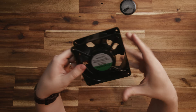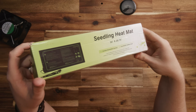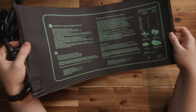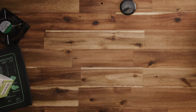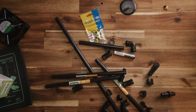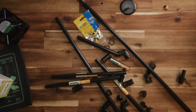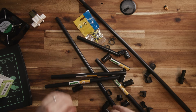To add heat so the little fiery fellas keep thriving on cold Victorian days, I'm using these cheap seedling heaters. They're only 20 watts, so they won't blow up the power bill too much, and they're waterproof. To add humidity, I'm using a cheap irrigation hose and misters system. Our greenhouse kit actually came with some of these plumbing bits, but I opted to overdo it and added some more misters from Bunnings. I'm using a solenoid valve, which is a few bucks on Amazon, to turn the water on and off.